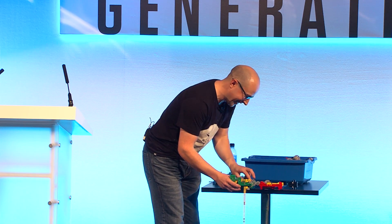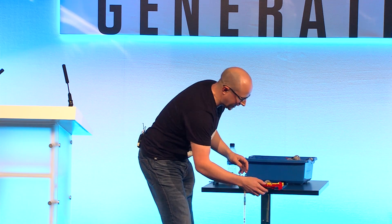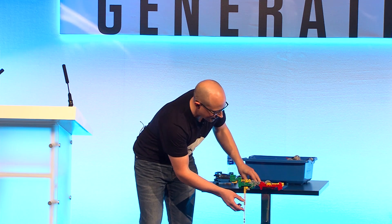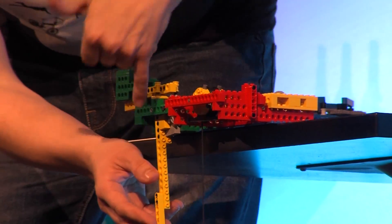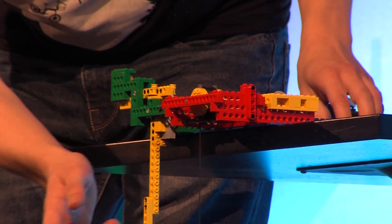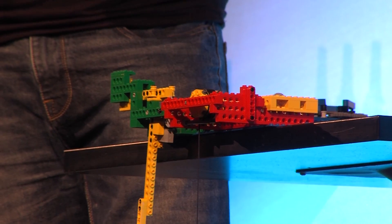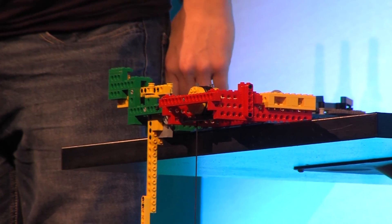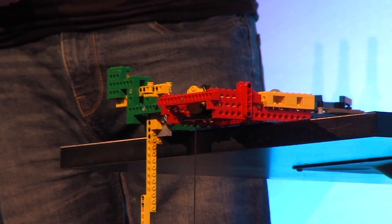It's much easier to see when it's attached to the clock. I let the weight go — nothing happens, because the pendulum isn't moving. As soon as I move it over to the right, if you watch this gear here, you can see it releases the gear, and now it's trying to push back. So it's releasing and pushing, releasing and pushing. And if I let it go, it just ticks on its own. I always find it amazing that that's just happening through gravity — it's a really fun mechanism to explore these forces.